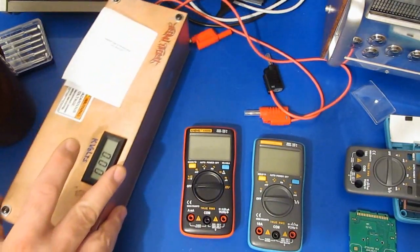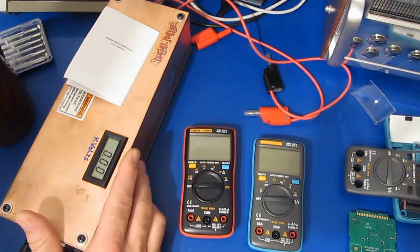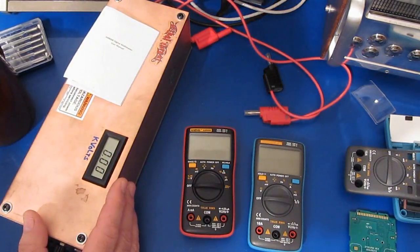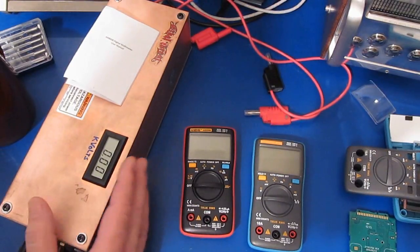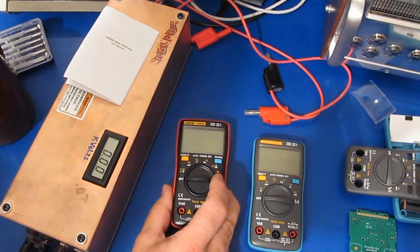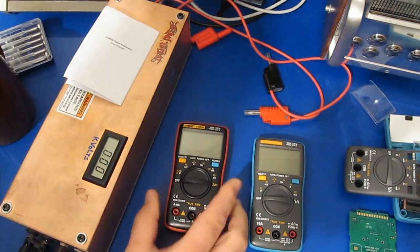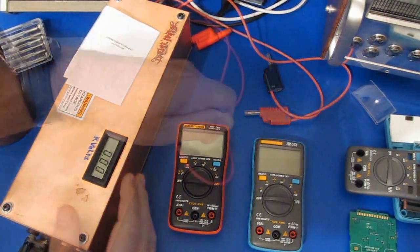My concern, the next test that we're going to run is going to be the ESD, and it's fairly high frequency. This thing puts out about a 4,000 volt peak at 15 amps, and it does that in under a nanosecond. So because of the high frequency and this thing being susceptible to high frequency, it'll be interesting to see if this thing will actually survive this test.